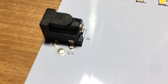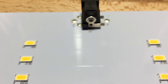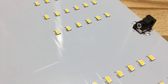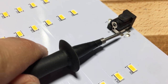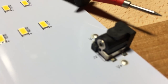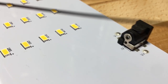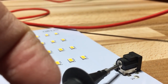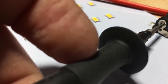Something funny I noticed just before soldering is that on connector J1 — the black barrel connector — the solder pads that say V+ and V- are actually labeled backwards. The V+ is negative and the V- is positive. You can tell by looking at the metal part of the barrel connector: that positive piece comes down and lines up with the negative solder pad. This issue only affects the first few batches of QB120s and has since been rectified, but if you have an earlier one, it's worth checking continuity with a meter to confirm polarity.